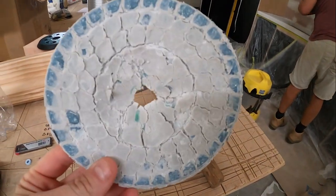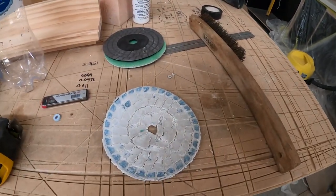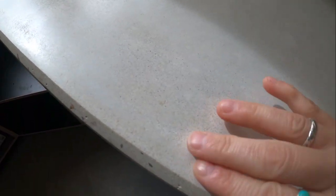was when we were finishing our benchtops using the products, we were getting a balling up effect of product and probably fines on the surface of the concrete. So it was balling up into like a gum and it was sticking to the surface of the concrete. And the worst part about it was the actual color from the resin pads that we were using, which were a yellowy, goldy color, was transferring into that gum. So we had yellow, goldy hue smudges and stripes in our slab,